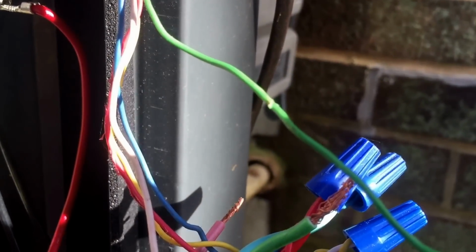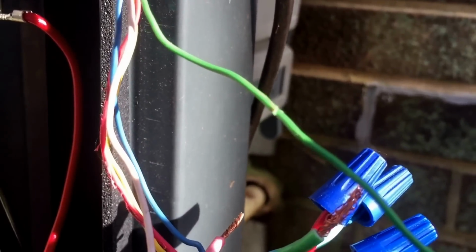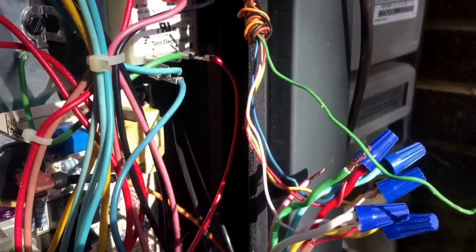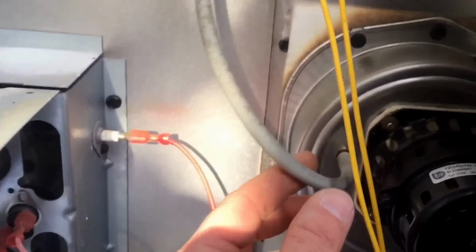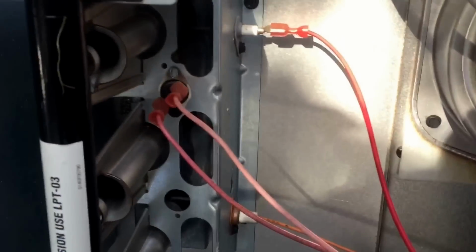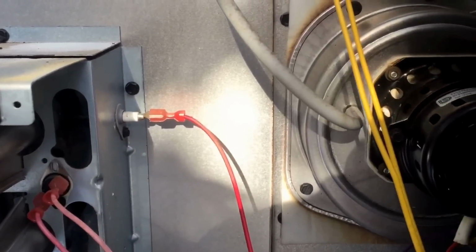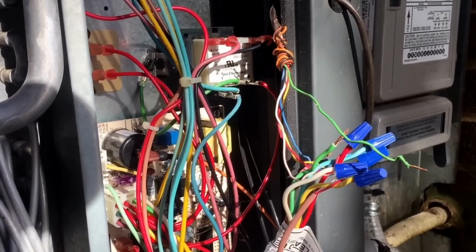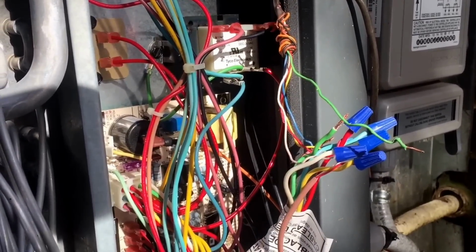It would appear that the system has just satisfied, and I did notice that we had some pretty ugly damage to the low voltage wiring, but nothing has blown a fuse or tripped that out. The pressure port is clear and there is no debris in the pressure inducer port hose. So I'm gonna pull power and fix that wiring and see if maybe there is some damage on the back of the circuit board or something like that.